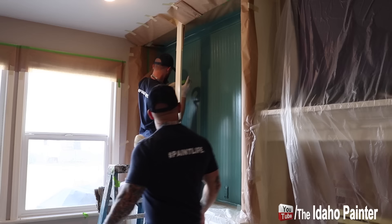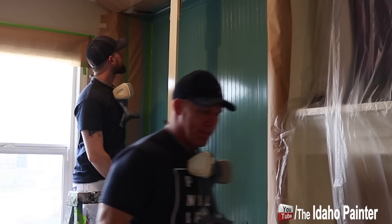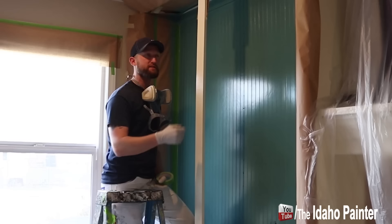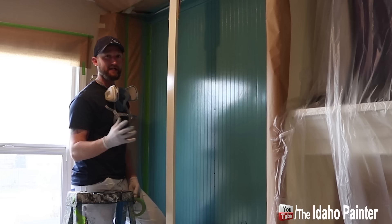Looks like you're experiencing some taping issues — you've got to re-tape before spraying. We used frog tape all the way around this deep color. We're not doing the white on the rest of the bookcase. It's curling the frog tape up. What we noticed is it didn't do it on Chris's where he did a lighter coat, but on mine where I did a heavier coat, it's sitting on those edges more. Whatever the chemicals are, or however fast it's drying, it's actually pulling that frog tape and causing it to curl back. So I am having to go through and re-mask those edges for the second coat. Keep that in mind when planning how thick and heavy of a coat you want to put on.